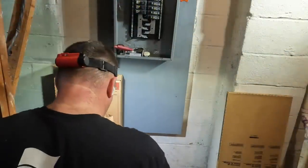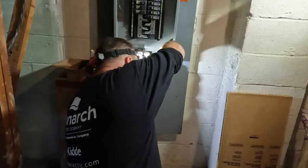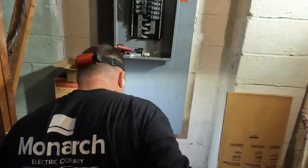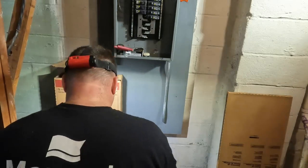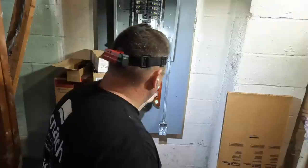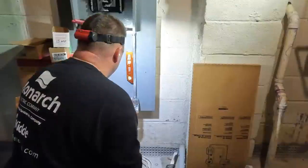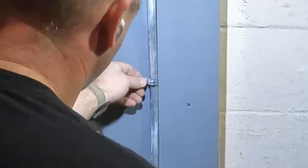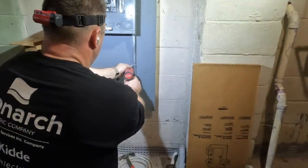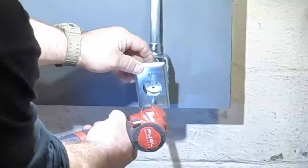That single receptacle will only serve the dehumidifier, which is what allows us to skip the GFCI. Check with your inspector before you do that — most inspectors in the state allow this, though the inspector could knock me down and I'd have to put in the GFCI. The trouble is you'd have the potential for a nuisance trip, and if that dehumidifier is important and you're away from home for a few days, that could be a real problem. I take pride in what I do — I could have run PVC, but EMT looks sharper. Those back-to-back offset bends allow for a nice looking job.